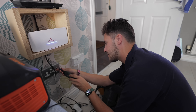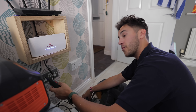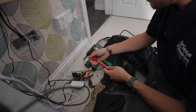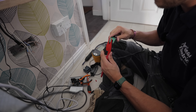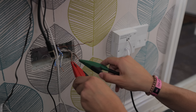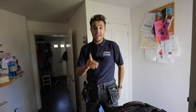Just got two more circuits left — both the socket circuits, both rings, shouldn't take too long. I'll just run around with this, see which ones are on that circuit, then I know which ones I need to test. Then I'm off to my final fault find of the day. So now time to do the ring final testing. I'll pop this on there — solid side to solid side. Zero that out. Get our end to end readings on each side of the ring: 0.56, 0.56. I'm expecting this to be 1.67 times higher because that's how much smaller it is than 2.5 mil. 0.92 — that is fine. On to the next one.